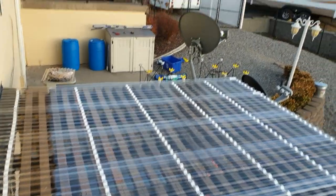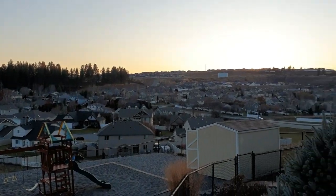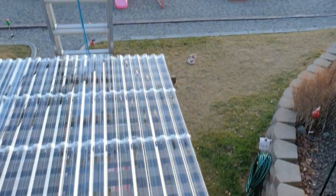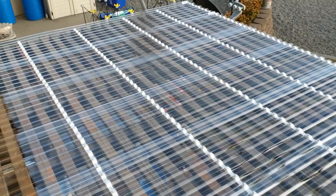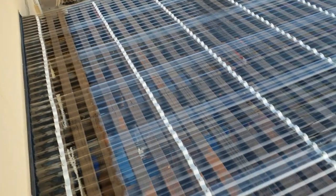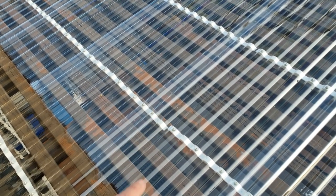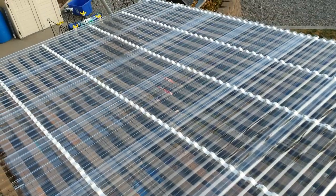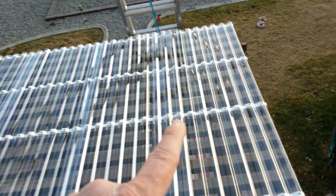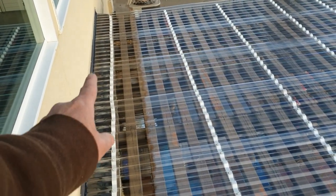We're getting this thing all wrapped up — sun is going down in about 30 minutes. From up top it looks okay. The hardest part was keeping these little foam closure strips straight — one section broke through the nail when I shifted the panel and I didn't notice until it was all screwed in. On this last panel I overlapped three places just to get it to come out on the edge, giving a factory edge there. All the cut seams are up against the wall — real nice and tight.